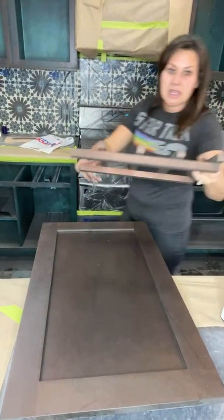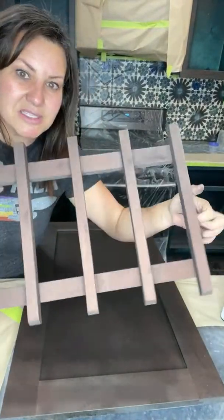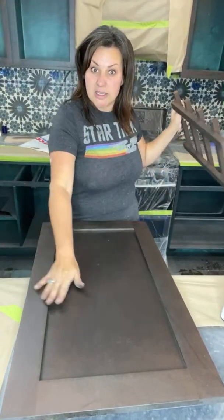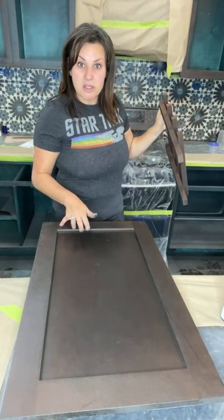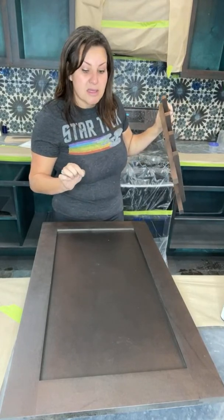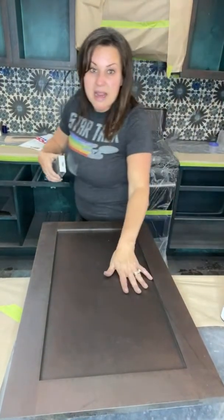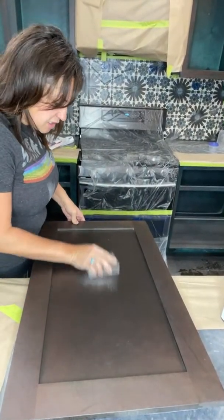This is what it looks like before. So you can see, it kind of looks washed out. This lighting here, I don't know, I'm going to get used to it. But it's very sparkly, it's very brown. And then I've got 2 coats, a top coat on this. It's an oil-based top coat. I used Sherwin-Williams pre-cat. There's a pre-sealer that you can put on, and that's what's on there now. So that means that everything that's on here currently is locked. It is locked and ready to go.